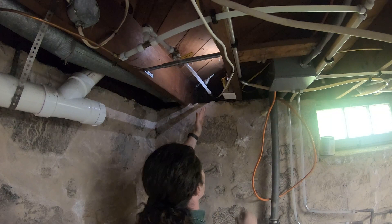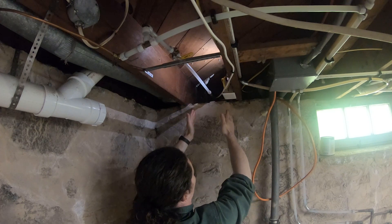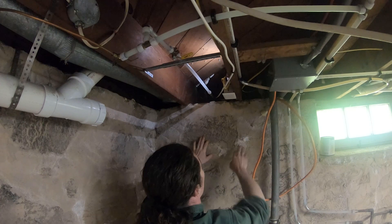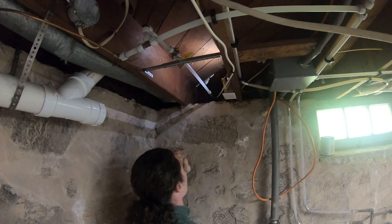As you can see, we have the cold water coming here, a joist here and a joist here. Once we remove this, we're going to want to take a measurement with the new faucet and confirm we're laying out in the right spot. We also have some wires and cables to watch out for when we go to drill that new hole. We'll get this cut and then measure everything out to make sure our new layout is going to work.